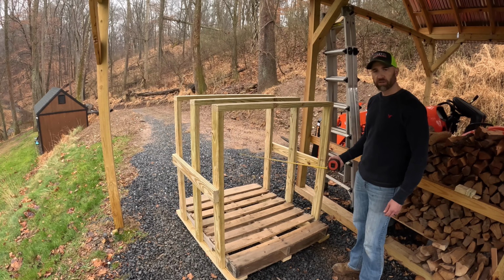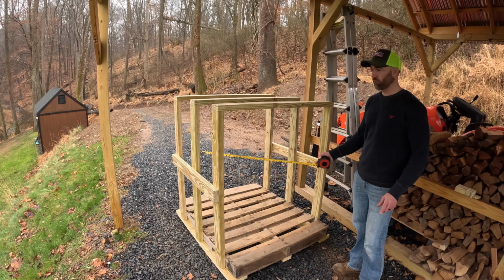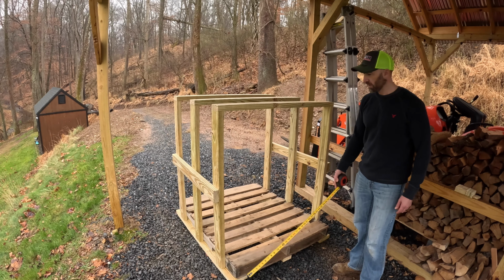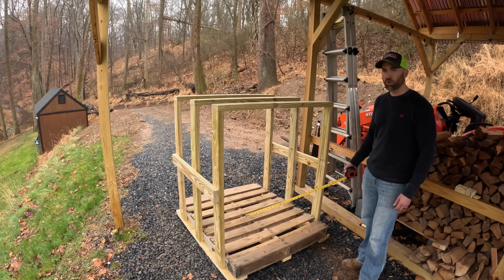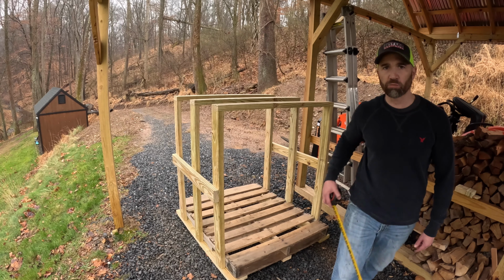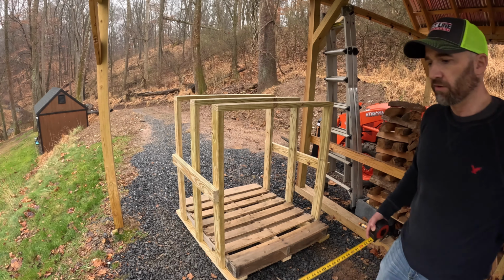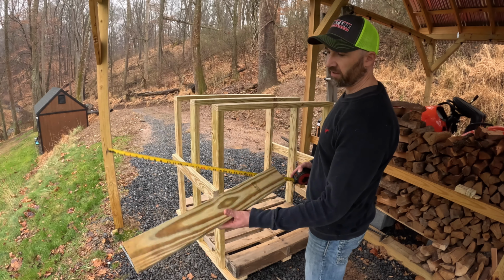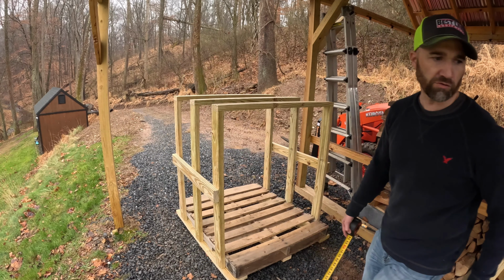Again, we used 6 8-foot long 2x4s and then 1 8-foot long 2x6. So, price that out at your local lumber yard, but you're gonna be somewhere right around $40 to $45 if you put those bottom skids on, and then you still have a little piece left over. So this is what's gonna be left. You've got a 26 inch piece of 2x4 left over.